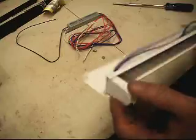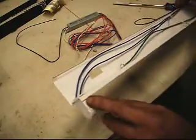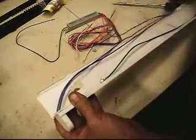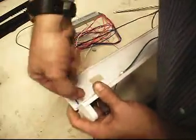Looks like they're fitted in there with a lock tab, so I'm going to see if I can get away with not performing a lot of work and just wiggling these out from this side. I'm using a twisting motion while I am pulling straight up and out of the tombstone. Same thing with this one.